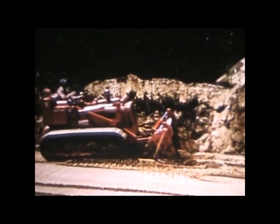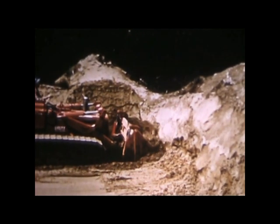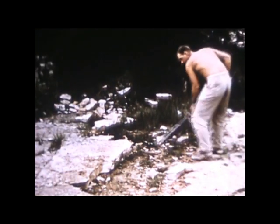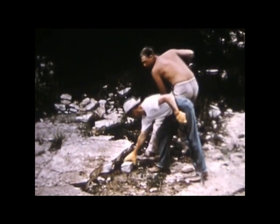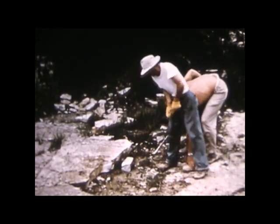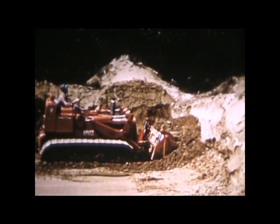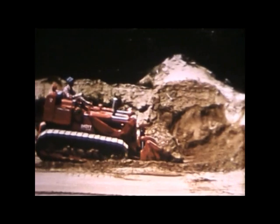When you're working in tight against the wall of the excavation, you'll notice another advantage to that rollback action of the bucket. You get a powerful pry-out action, just like a crowbar, to fill up the bucket. The bucket is much closer to the tractor, helping to improve the balance of the machine. That low-down fulcrum action lets a little guy lift much more than a big guy can lift. That's a full 41-degree tip back at ground level — and it takes that big an angle to give you fully loaded buckets each time with no spill when you're carrying.